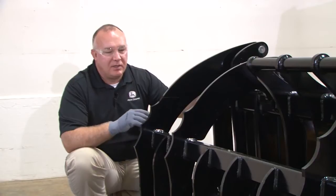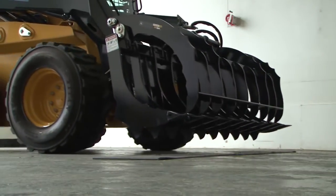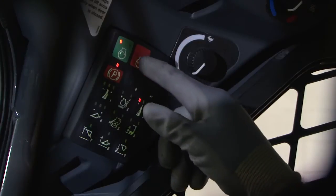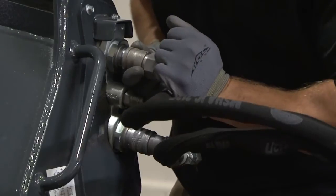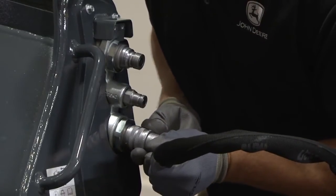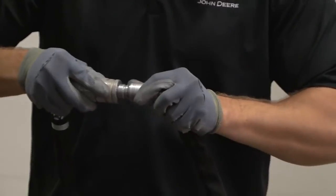At the end of the day, it is very important to be sure your attachment is clean and free of dirt and debris. To remove the attachment, first bring the machine to a complete stop and lower the attachment until it is securely resting on level ground. Turn off the machine and exit the cab. To unhook the couplers, it is recommended to detach the supply line first, then the return. It is recommended to press in and hold the male and female auxiliary port couplers to relieve system pressure. Once the couplers have been disconnected from the machine, connect them together to eliminate buildup of debris during storage.